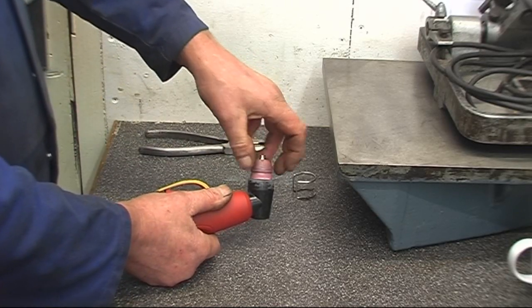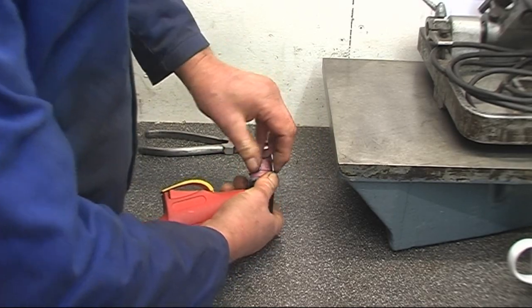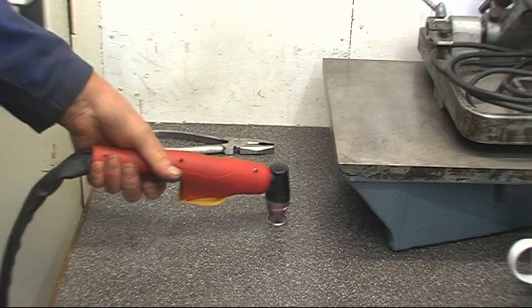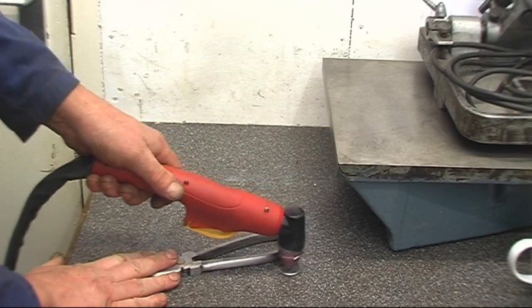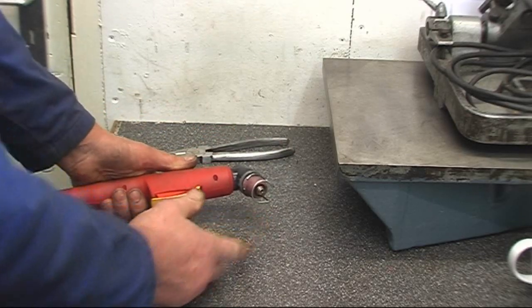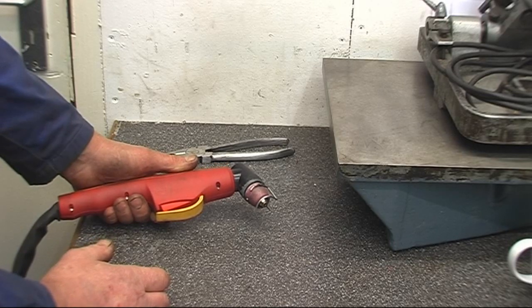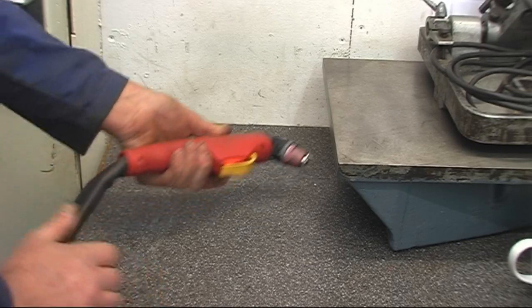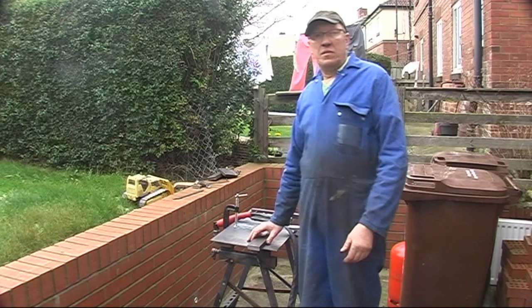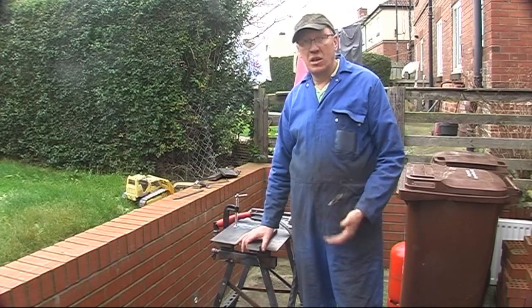The ceramic screws back on. The metal gate goes on like that — when you're cutting you can use it as a guide to cut down an edge. It keeps the tip the right distance from the work piece, ideally between one and two millimetres. This is 19mm plate — three quarter inch plate — and I'm going to go straight in and try and cut it.